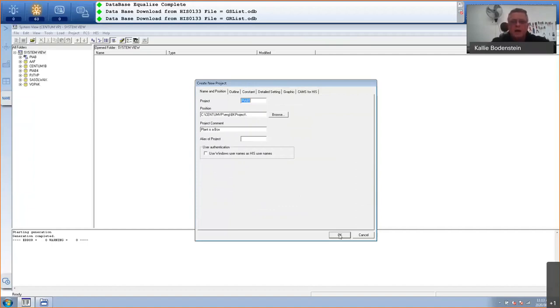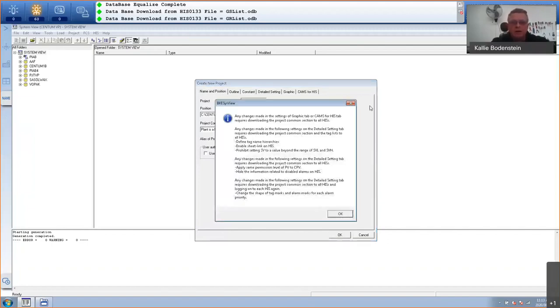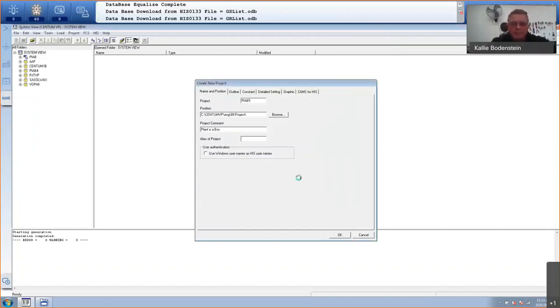So this will now create a new project called Plant in a Box 5 in my system view. It'll give me some information about CAMS, which is Consolidated Alarm Management Software, which is a very nice package, that you can actually consolidate some of your alarms, do a lot of things with that. And I am happy with this. So it's busy creating my new project, and you should actually see a project called Plant in a Box 5